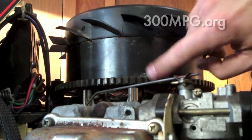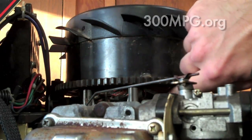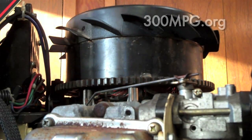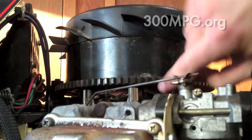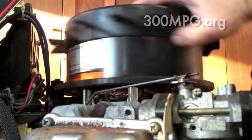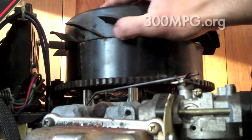This cup has the permanent magnets inside of it. If you look down in here, you can see the coils of the generator — those are copper coils that the electricity is going to flow through, but those are fixed. That's actually the stator. If you watch, when I rotate this, those coils do not move with it because they're part of the stator.